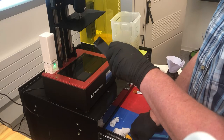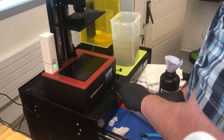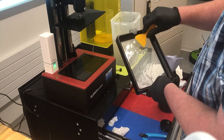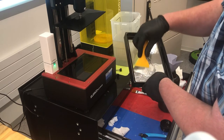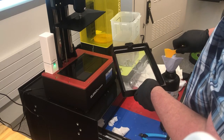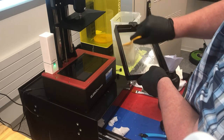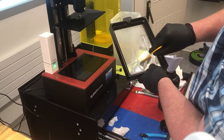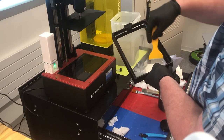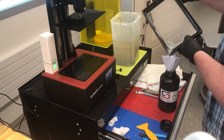I got most of it out, so I'm going to take my yellow squeegee — or putty knife, whatever you want to call it — and scrape very gently. We don't want to push too hard and bruise or dent the FEP sheet. I dump the scrapings into my funnel because some more may drain off. Then I use the squeegee to scrape everything down. You'll see on the tray there's a corner with a notch for pouring, and that's the corner I'm pouring from. Then I'll pour the last little bit into the bottle.